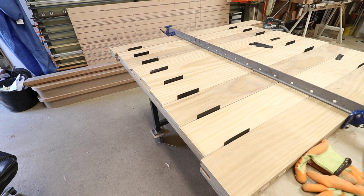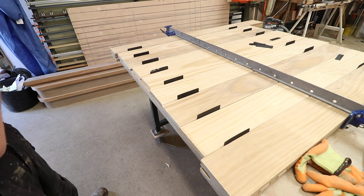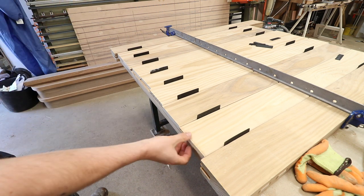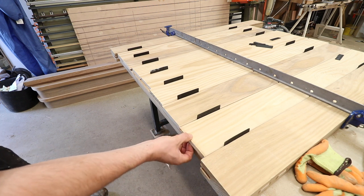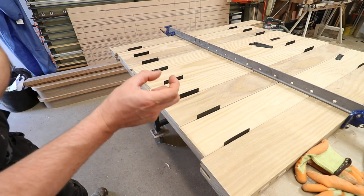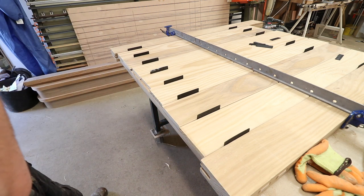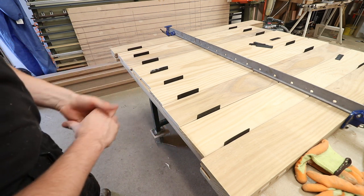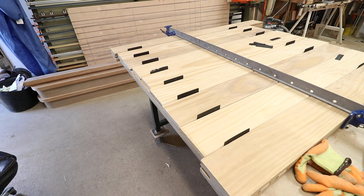You're probably thinking: why don't you buy a cutter set to machine the boards in just one pass? You could do that if you're doing a lot of one specific size of board. But I'm always changing the width of the board - these are 18mm for a standard door, but for a double-boarded door you can only get away with about 12mm boards each side to get enough insulation in the middle. So depending on the application, I'm doing lots of different thickness boarding and generally end up making the boards to suit the door. Hope you've enjoyed the video - give us a comment if you've got any questions and don't forget to like and subscribe.